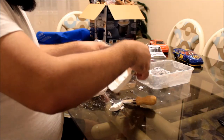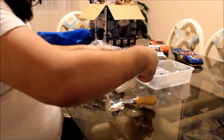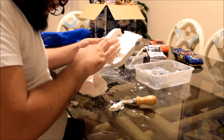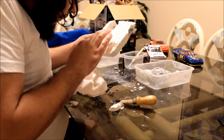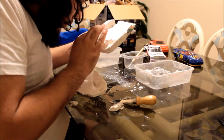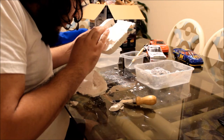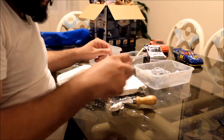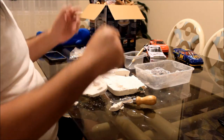Look for any imperfections in your mold. You can fix them by applying a little bit of putty, clay, or basically anything else that will stick to it. Also give it a thick spraying of liquid enamel to get rid of any micro bubbles that may have been left. After that is done, be sure to reapply the soap mixture to the two halves of the mold. Now that the mold is ready, we are going to fill it with the material our final prop is made out of. For my prop, I'll be using Loctite foam for gaps and cracks.